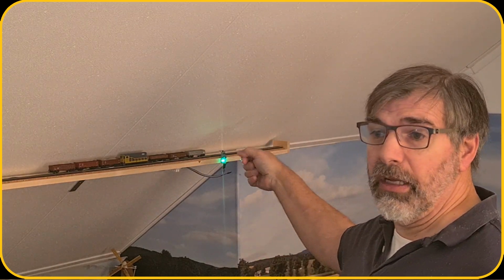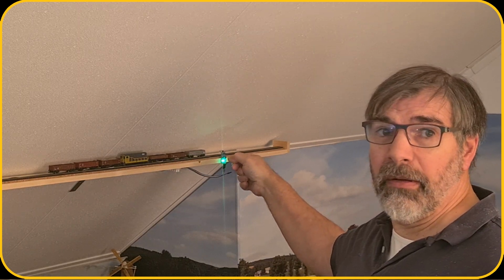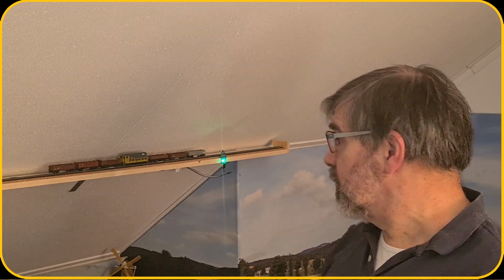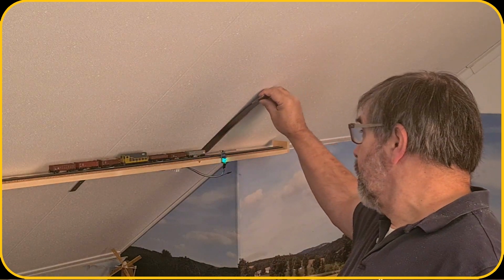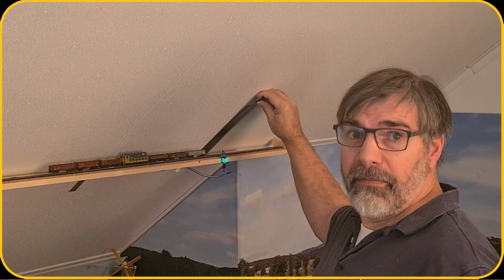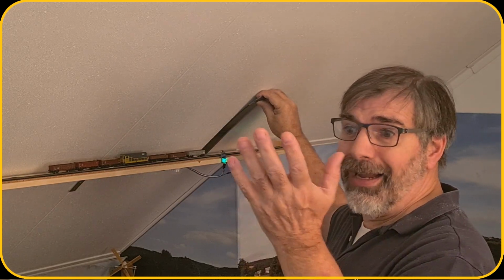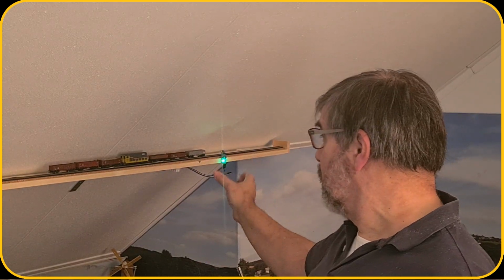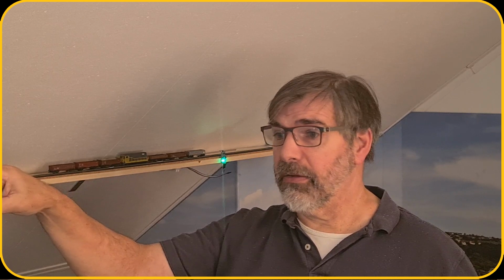and I can adjust the intensity of the detection, but the problem is that it will not solve the issue because of the bright light of the infrared, which is in the sunlight, etc. So that is something what you need to be aware of when using infrared sensors, that you need to make sure that there is something which doesn't reflect the infrared or light on the sensor. So that is what I'm going to do here to prevent it, and I'm going to do the same at the other end so that we don't run into that issue as well, especially during the day.